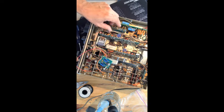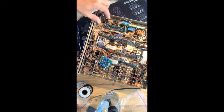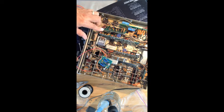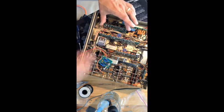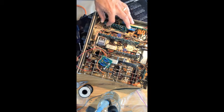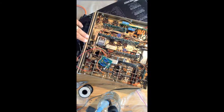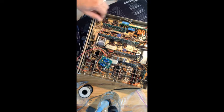Q10 has to be removed, and I'll be using that hole for power for one of the other mods — that's what the instructions say. I've already taken the liberty of removing it to get in there a little easier to remove some of the wiring. You're going to have to use your schematics from the original R4C schematic diagram to figure out what you need to do here. The instructions are expert level, I would say — they're not all that clear. It's not like building a Heathkit or an Elecraft where they go step by step. You kind of have to know a little bit more about what you're doing.